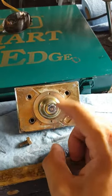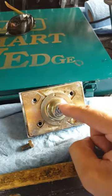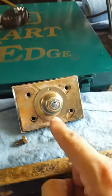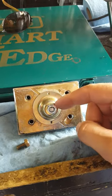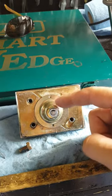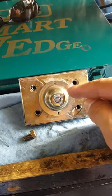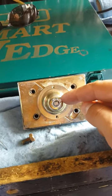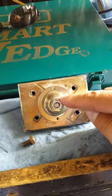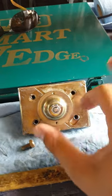It has a spring constantly putting tension on it, but as you can see I can tighten or loosen that nut. When I took this box apart, that flange — that little whatever you want to call it — was not bent like the other two, which is what's allowing that nut to actually back itself off. So the lock nut function of this product was not functioning.